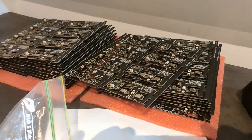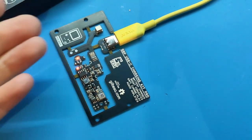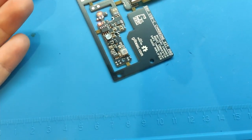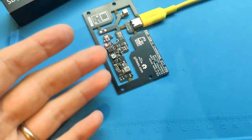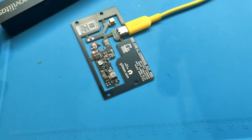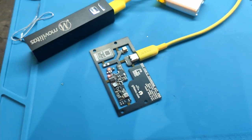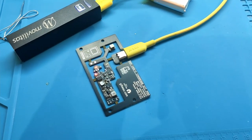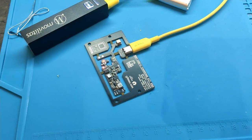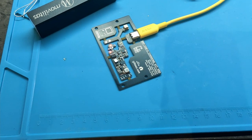Of course, I cannot change the resistors in all the panels you made because there are 320 resistors. Sometimes in the factory a connector or a light is bad and I can fix it by hand if it's only 5 or 10, but this is a specific case where 320 resistors have the wrong value. So I hope you can help me because I'm very disappointed. You can see in the files how I specified the resistor as 2.2 ohms, not 18,000.